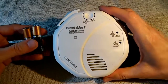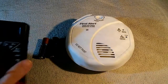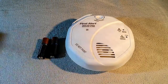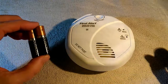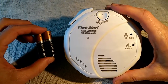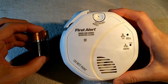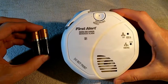So what I'm going to do is put two fresh alkaline batteries into my smoke alarm. I have confirmed that they are good — I have measured them at 1.56 volts, which means they are fully charged. These batteries are dated 2024. We're going to put them in and see how long this smoke alarm goes before the batteries drop to 1.25 volts and it starts chirping. Then we will recharge the batteries and run the experiment again, which should give us a pretty good estimate of the relative amount of energy we were actually able to put back into these batteries by recharging them.